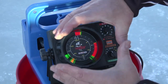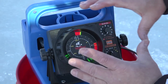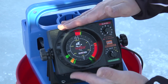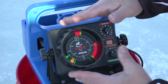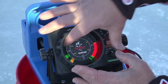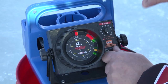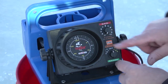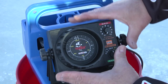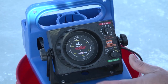The more space you give the bottom display on your wheel, the better the resolution can be. And the FL8 has the best resolution of 525 lines in the marketplace today. So you got the best there is, but if you don't set the range correctly to maximize the window, you're just going to be compressing your signal down smaller and smaller and smaller, and you won't be able to see anything. And that's one of the big advantages of why we have so many different depth ranges, 6 different depth ranges on your FL8.